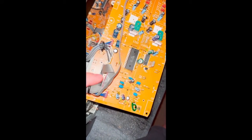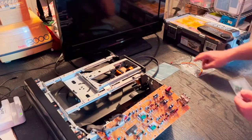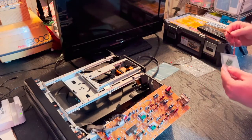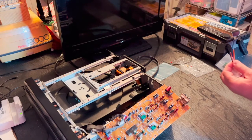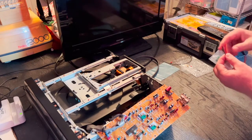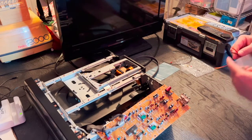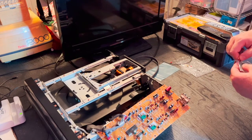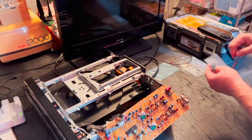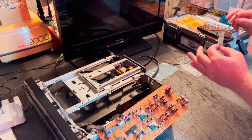The first thing I'm going to do is tin the pads on the circuit board, and cut and tin the wires. I'm not going to video all that — I'll show you the finished product. If you're not that handy with a soldering iron, look up videos on tinning — it basically just prepares the wires and the pads to make the job of connecting them easier and a lot less messy. One thing you don't want to do is bridge the pads by accident — you want to keep the solder nice and clean.